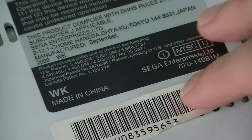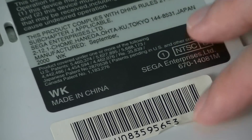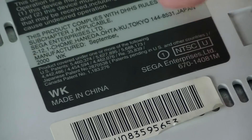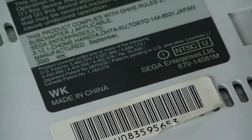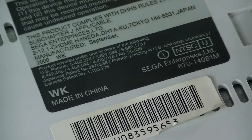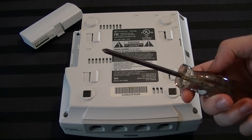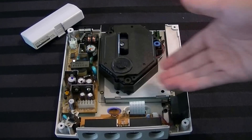To begin installation, the first thing we have to do is flip it over to the bottom. You'll see a sticker or something very similar. This basically says it's NTSC-U, meaning it's North American. The device is region free, so it doesn't matter if it's NTSC-U, NTSC-J, or PAL. What matters is the number next to it. If it says a circle with a number one, you're good. If it says a circle with a zero, you're also good. However, if it's a circle with a two in it, that means it's revision two and this board is not compatible with revision twos — so make sure to check that before you buy this thing. Odds are you have revision one because that's by far the most common version.